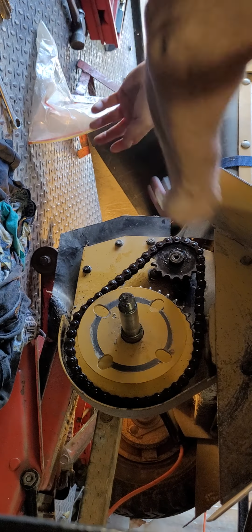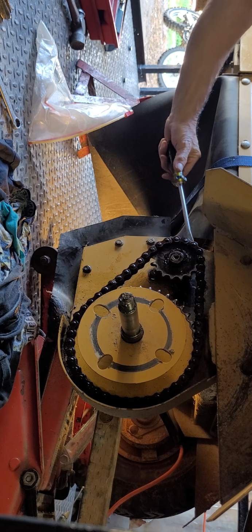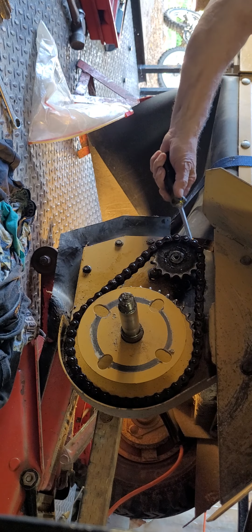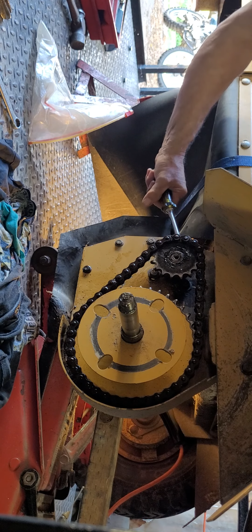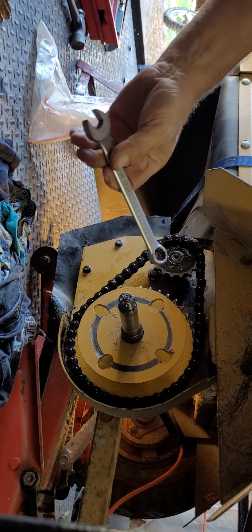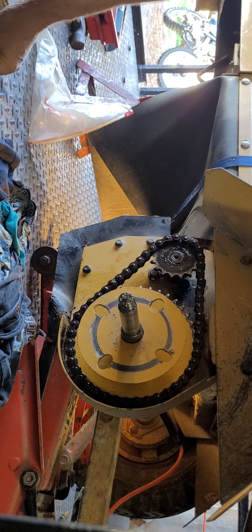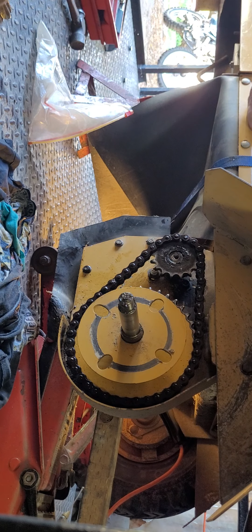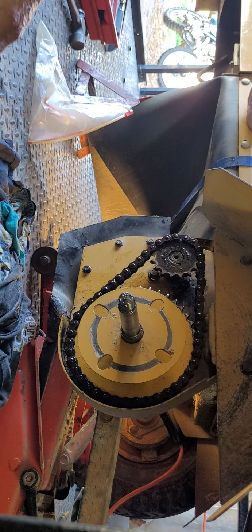All right. So we greased up the chain so it'll move a lot easier. Now you go to the back of the sprocket, and you can see the bolts and stuff, and move the sprocket ahead. So move the sprocket ahead. Then it's 9/16, guys. You got to move it ahead until you can get the box end on, eh? Because the open end won't do it. It'll strip it.